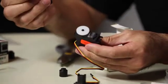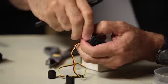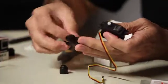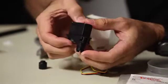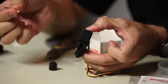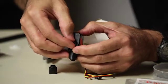The next step is to take a Phillips screwdriver and remove the existing servo horn. Once you've loosened that screw, keep it — don't lose that. Put it in with your other screws and pop off the servo horn. Now we're ready to mount the servo onto the bracket. Looking at the bracket, there's a hole through the middle and posts on the back side. Simply take that bracket, make sure the white gear of the servo is visible through the top, turn it over, and take your four screws — one each into the mounting posts on the back. Make sure you understand we're using metal screws into plastic, so we do not want to over-tighten these. If we strip that bracket out, we've ruined it. Let's keep that in mind as we mount the servo using the Phillips head screws.